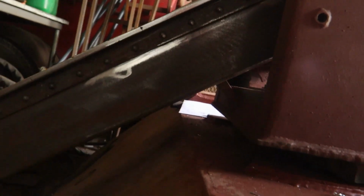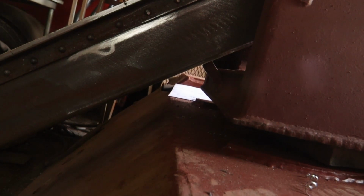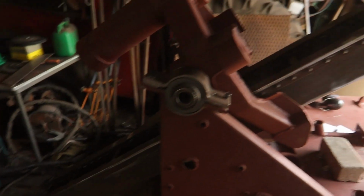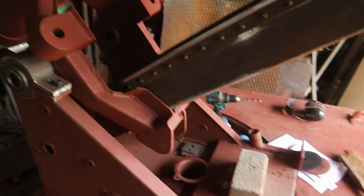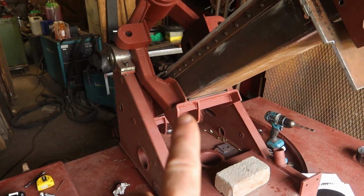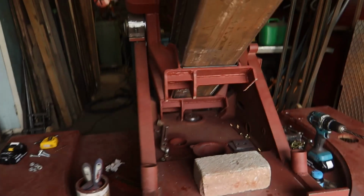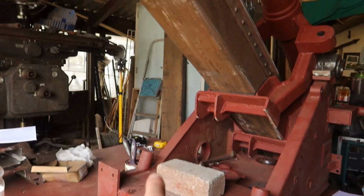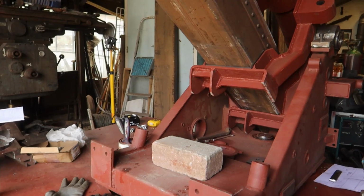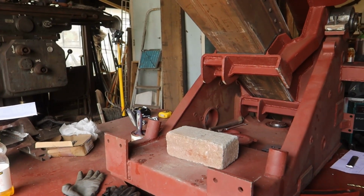And down there you can see the stop for the elevation, and it's touching it. So again, here 2 bolts, plenty of room for drilling. This bracket and the one below there, it will contain the gear for elevation. And then you see behind the brick the hole, that's for the gear itself that will touch the gear that's in that bracket, and for driving it.